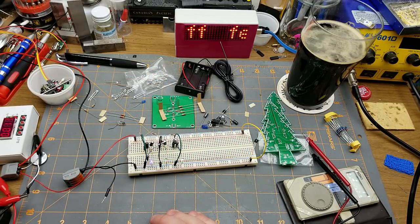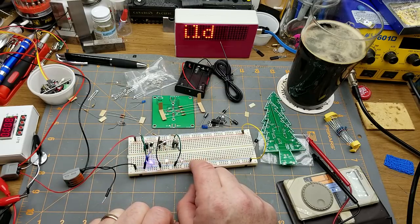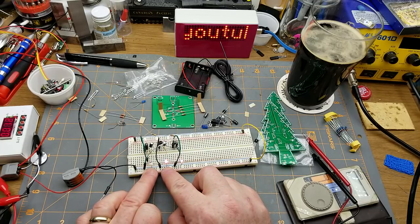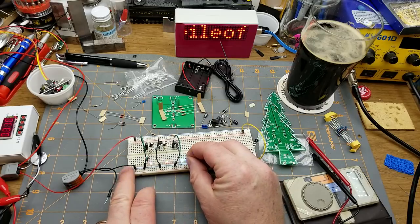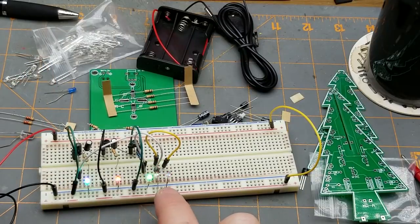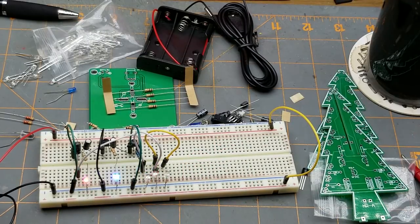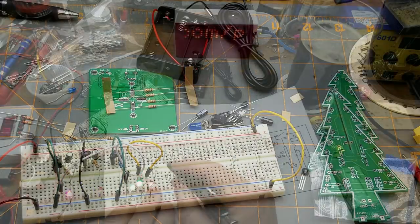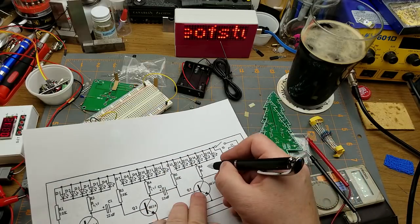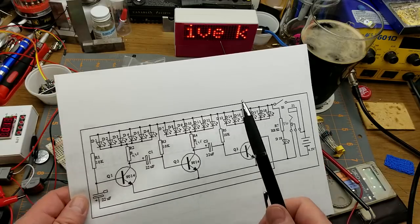But that's not what this kit came with — it came with these funky self-blinking LEDs. What's the benefit of having this oscillator shimmy between the three groups? You get a little more off time, maybe. My options are to either bypass all the circuitry and just give these things full-time power, or run it as designed. I'm going to use 330 ohm resistors for all the current limiting, and other than that no other major modifications.